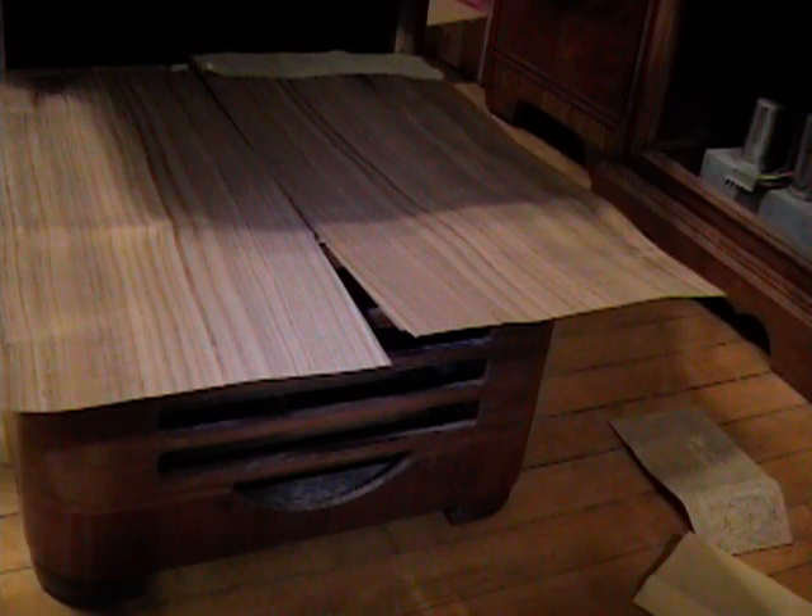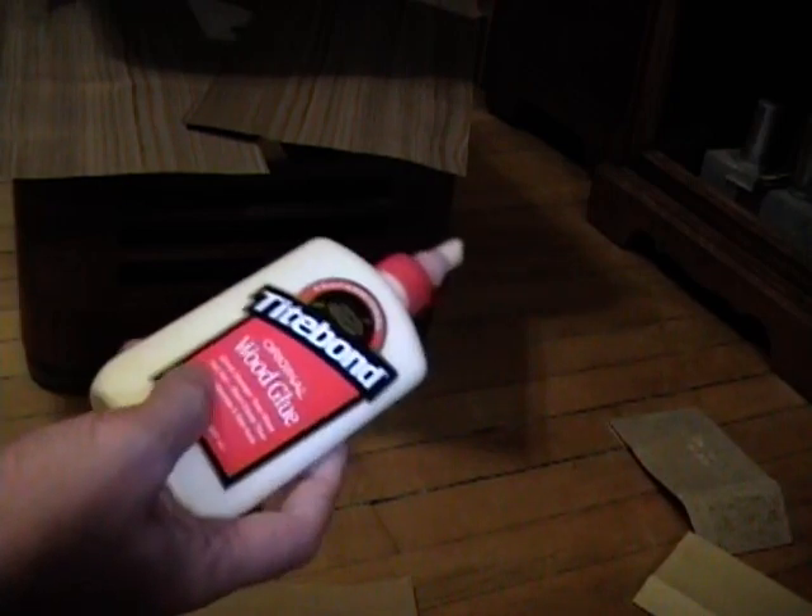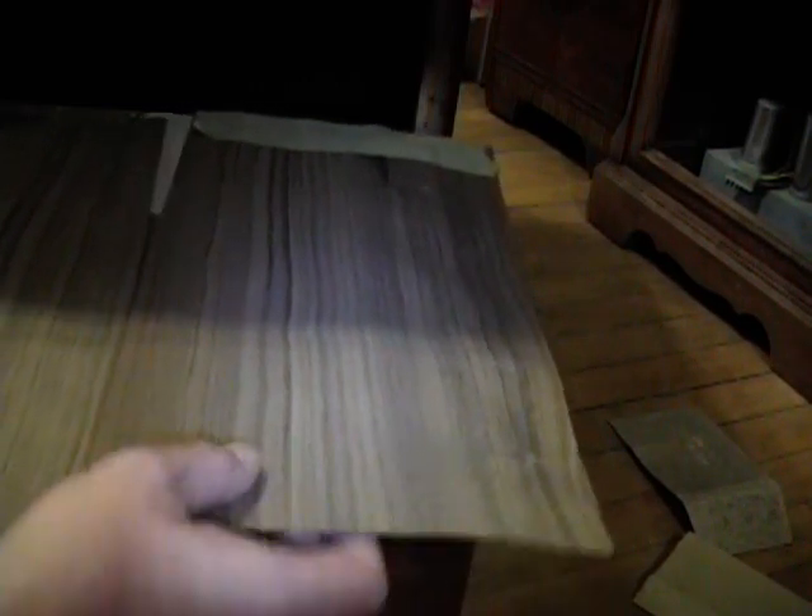In the past I used some veneer that already has multiple sections glued together with a paper backing, which is pretty easy to work with. I put on some Titebond glue both to the veneer backing and the wood, let it dry, and then ironed it to reactivate the glue. That's not going to work so well on this stuff because there is no paper backing. When I put glue on it or get it wet, it's going to curl up really badly. So I need to keep a lot of pressure on it to keep it very flat. I also have to join these two edges together.